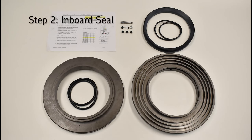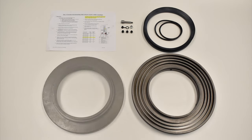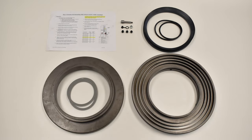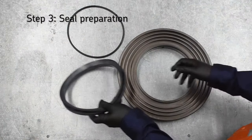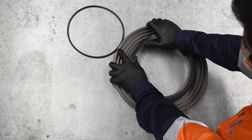One TKN seal kit contains all components to assemble the seal for one side of the housing. The set includes an installation instructions page, one grease adapter, three set screws, V-ring seal, shaft O-ring, rotating labyrinth seal, stationary seal carrier, and seal O-ring. Position the V-ring on the labyrinth ring step, with the V-ring lip facing away from the labyrinth ring.